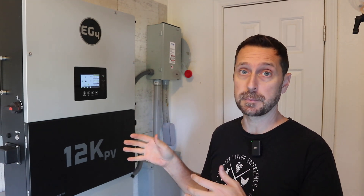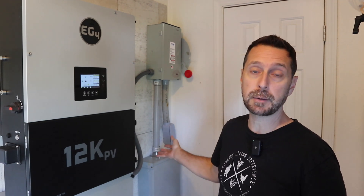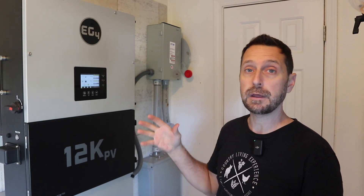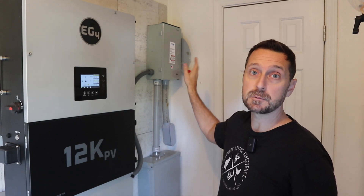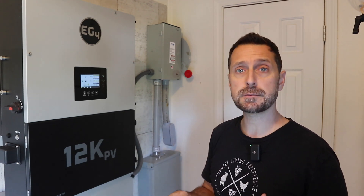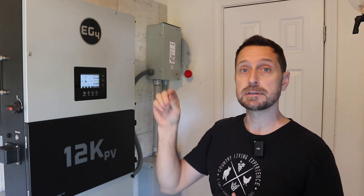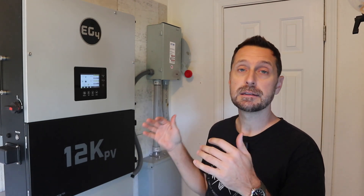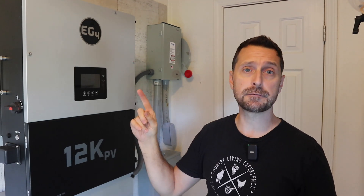That's it — just a few simple settings for us for off-grid mode. Each one of you will do different settings for whatever your setup is. That's how you connect this to a simple critical loads panel. You can move as many circuits as you want from your main over to your critical loads — whatever your inverter will handle — and we simply switch everything between grid and solar with the manual transfer switch. You can get into automatic transfer switches or special transfer switches that switch specific circuits if you want, but for this specific application this was the simplest and easiest way. If you have any questions, please leave a comment below. Have a beautiful, blessed day — we'll see you next time.